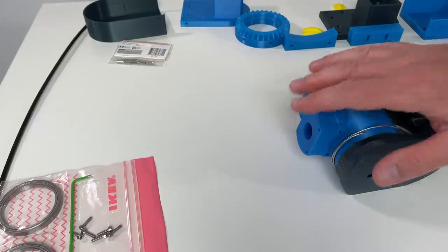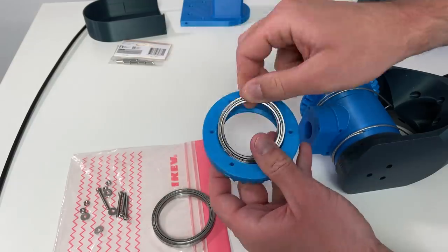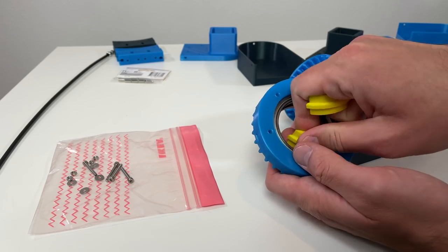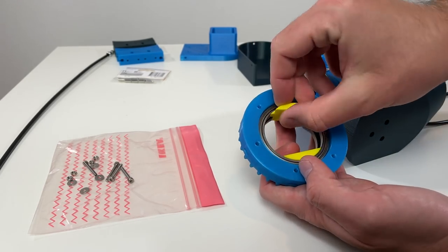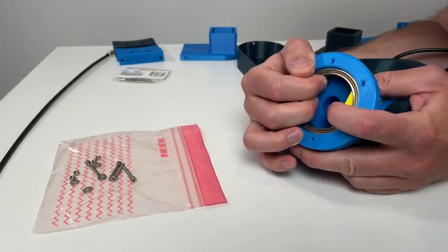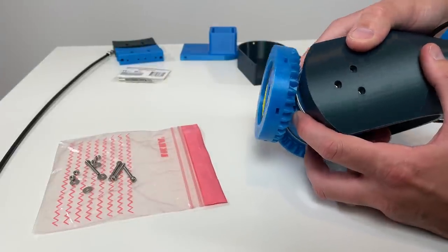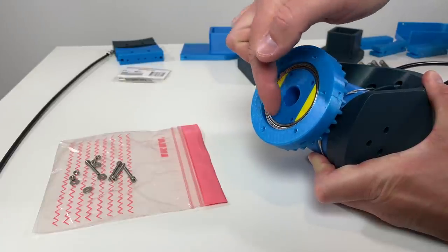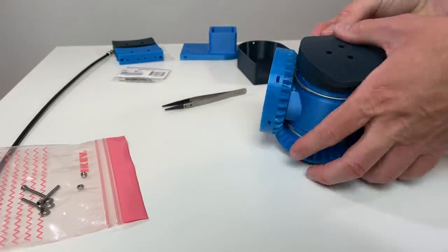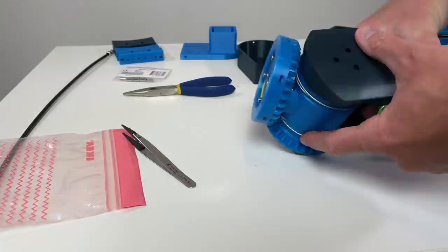Anyway, let's continue with the assembly. Over here we need to install the output piece. For this piece I need 6710 bearings. The yellow pieces go inside on both sides, and afterwards we can install it — just need to align everything. Now we install embedded nuts and secure the output with screws. There is no big backlash between the output and this gear, which is good.